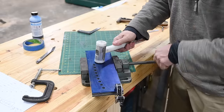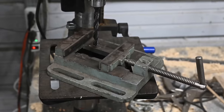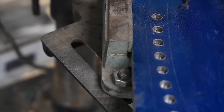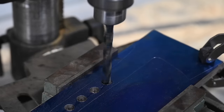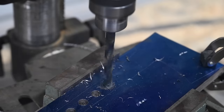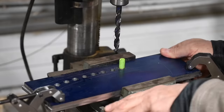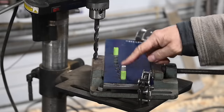Now a super simple method — probably the simplest method of drilling accurately placed holes. I'm using a drilling vice instead of vice grip clamps, with one corner loosely anchored to the table to avoid helicoptering. The only drawback is it depends on having a drilling guide — pre-drilled holes in another piece of metal. But here I've already made one, so I'll use the first hatchet copy as a guide and drill straight through the previous holes. If you're doing a bunch of copies, this saves enormous amounts of time. Key point: use locator pins to accurately maintain all the distances, otherwise things shift and get out of whack.